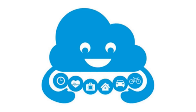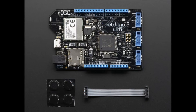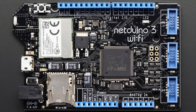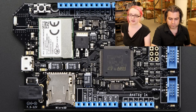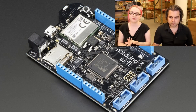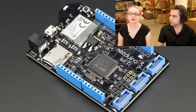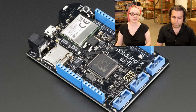Because we have some Internet of Things stuff going on — Nimbus, the friendly cloud entity, is here — the Netduino 3 Wi-Fi is out. This is a monster board. It uses the CC3100 module, which is the next generation after the 3000, and it's basically an SPI Wi-Fi module. It has that .NET infrastructure, so you can program it if you're a Windows or Microsoft person. It lets you mix the joy of doing Arduino-like things with the joy of .NET. It has Wi-Fi, libraries, a microSD socket, power plug, big ARM chip in the middle for the STM processor. People like Netduino — we have the latest.